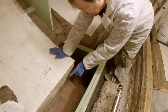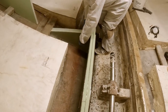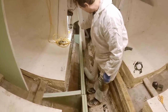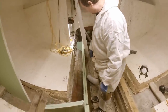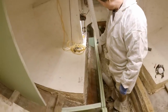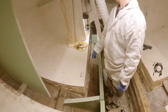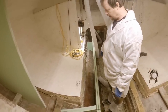This area right here will become a sump for the back fish hold, and we'll have a pipe going through here. There's also a forward brace right there, and the height of that sump will go down to the top of that piece of foam. I'll put in a couple more pieces here, and we'll drill a hole for our drain pipe for the rear fish hold to go through there. Then it'll pop through the engine room bulkhead up forward, and we will tie it into a pump when we get to that point.